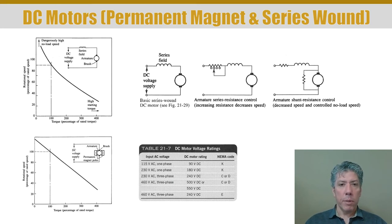The type of DC motor you're probably familiar with is called the permanent magnet motor. Here, the stator field is generated by just permanent magnets — no current flows through that — and you simply allow current to flow through the rotor. This type of DC motor has a very linear torque-speed curve, which can be a big advantage. The motors you find at home that are DC are probably all permanent magnet motors, while we're more talking about industrial motors here.